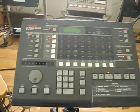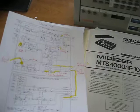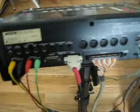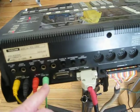This gives you a little bit better view of the Midiizer itself with the time code that's stored. These are some of the prints — this is a copy of the TASCAM 58 interface that I made to find the methodologies for locating the play and record and stop and start commands. The Midiizer diagrams themselves are very well done, and you can see schematics for pinouts and that sort of thing. The back of the Midiizer has master time code in and loop out connected back into the mixing board. I have the slave time code in and slave out as well.